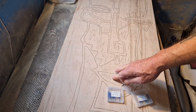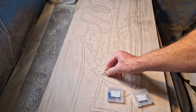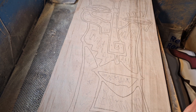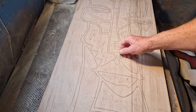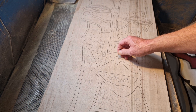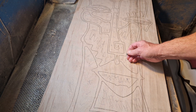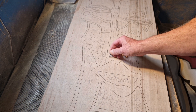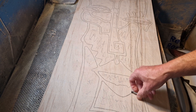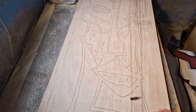Remember, we're doing inset — that's inside the piece. If we were coming from outside, that would be outset. We always route up to the line, never on the line itself. The reason being, if you have a small section and you route down on the line by three millimeters, you've narrowed that section. If you're doing a really detailed piece with only a couple of millimeters and you went on the line, you would basically route out that middle section altogether. So always up to the lines.